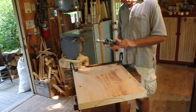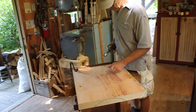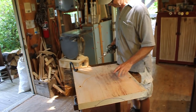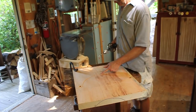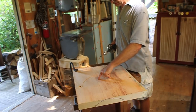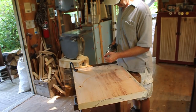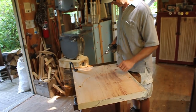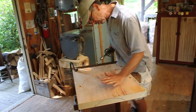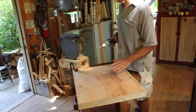I'm going to drill the depth holes now. My depth holes on almost all the chairs are the same: three and a half inches from the spindle deck, three and a half inches apart, and an inch deep. That's the way Dave Sawyer taught me to make chairs. It's a little harder to carve like that because it pushes your depth way back towards the spindle deck, but it sure is a lot more comfortable.